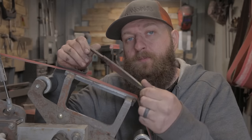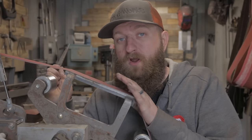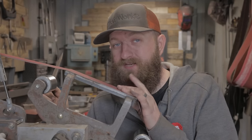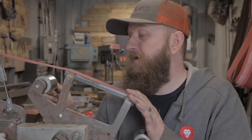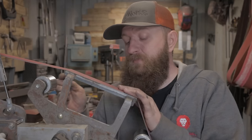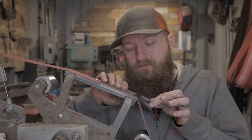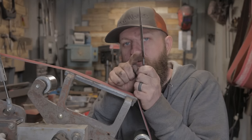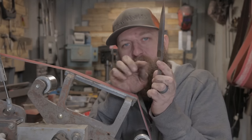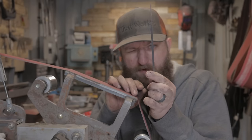So at this point, I got my blade out to about a 400 grit finish. From here, I'm going to use a waterfall platen to start truing up my plunges. Now, I'm not qualified at all to teach people how to use this. I've only done it a few times, but what I can do is give you the basics. Basically, I'm working on this edge here, keeping my blade nice and flat and slowly pushing up to give my plunge a slight radius. I can also do a little bit of course correction if my plunges are off by a little bit, which they're not, they're very good.